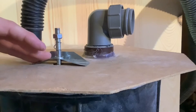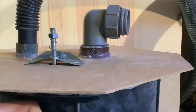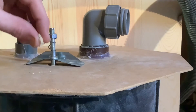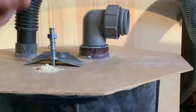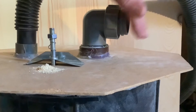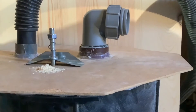Here is the valve installed in place. This is the vacuum — air is being sucked out of here and dust is being sucked in here and into the collection tank beneath. To demonstrate this, I'm going to use, ironically, some sawdust, which I'm going to place down there. When I turn the vacuum on, air will be rushing through and the valve should remain closed — meaning that sawdust won't go anywhere. But when I block the inlet while the vacuum is running, it stops the airflow going in, but there's still lots going out, so we start to get a lot of negative pressure inside the bucket. The lid will suck down, but the valve should open and this dust should fly in.